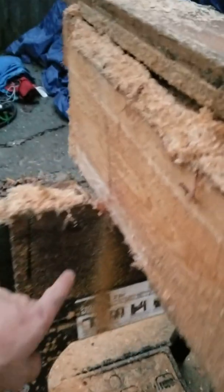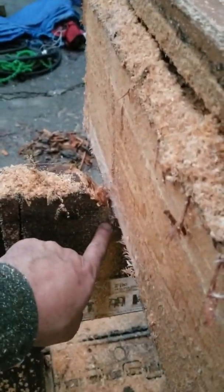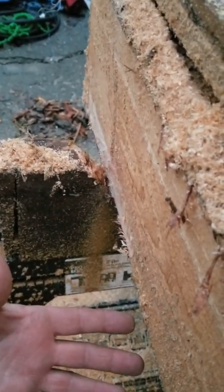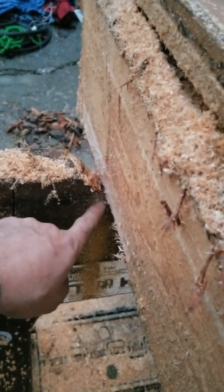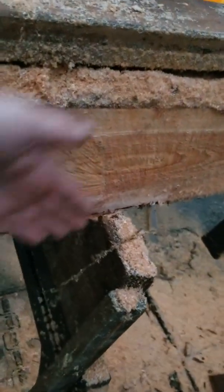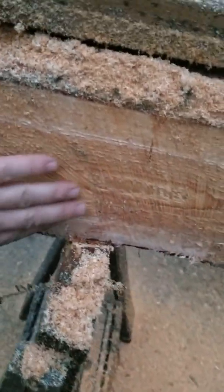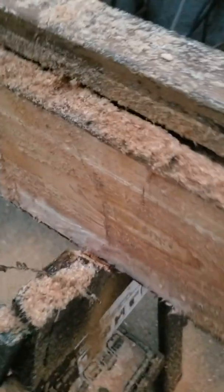But what I noticed is where I have it braced, I cut a notch in a couple 2x6s, and where it was resting, I was actually going to cut through. So you might want a wider notch to make sure you're not going to end up cutting where it's resting. So I had to lift the saw a little bit. I finished my cut, lifted, came up over it and back down to leave that where it's resting, and then I zipped it off when I was done. That left me with a bump. That's okay, I'm going to plane it out, but lesson learned.